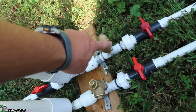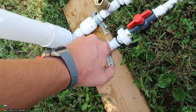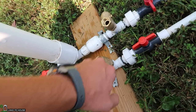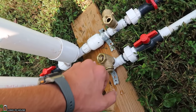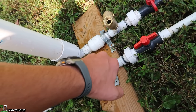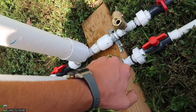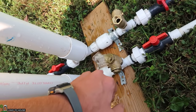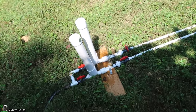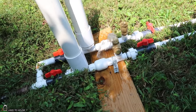I'm going to leave this side off over here and turn this one on. I've already got some water in the delivery pipe, so I need to cycle this until the pump starts working on its own, which means it has to put water into the delivery pipe — something called back pressure. Without pressure pushing down on this tank, the pump won't cycle on its own. And the first pump is cycling on its own, which means there's now enough water weight in this garden hose to keep back pressure on the pump.